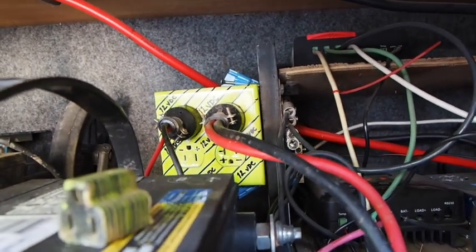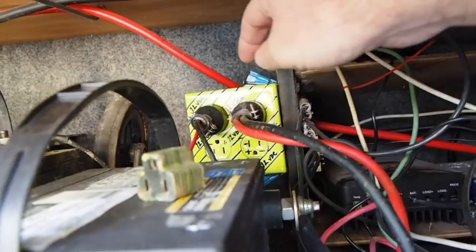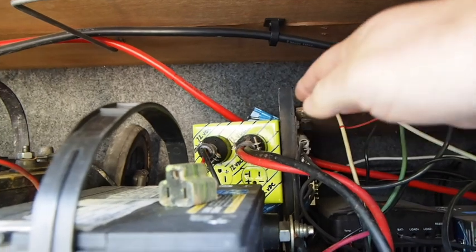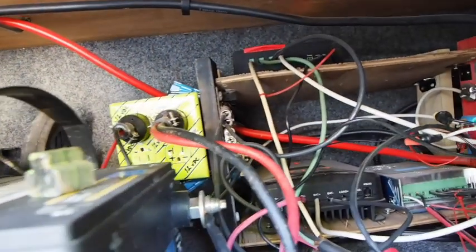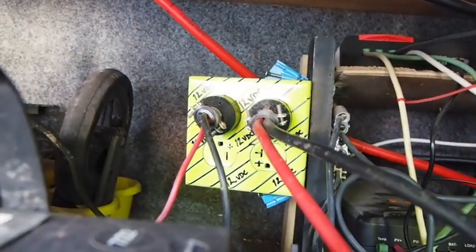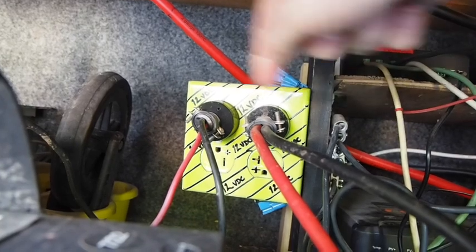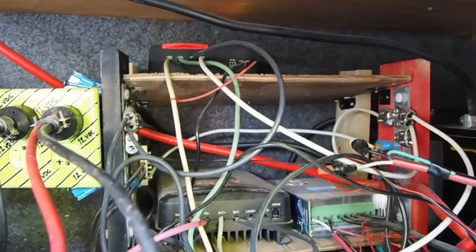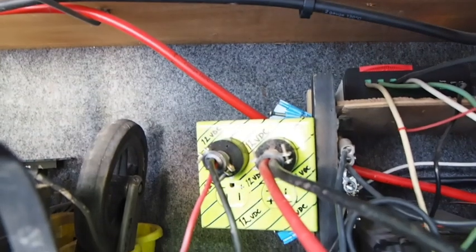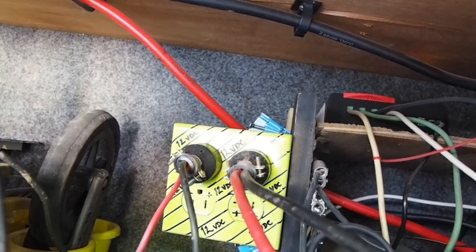As a refinement to that — let me show you what I did — I set up ordinary household outlets back here, two sets of outlets with a junction box and a cover. I spray painted this lime green. One set of outlets is mounted upside down relative to the other, which was really for my own convenience for wiring on the inside of the junction box. I tied these two together and ran wiring from them to the bus bars on the rack that holds all of my solar charge controllers, so these outlets are tied into the solar charge controller bus bars, which are tied to the battery bank.